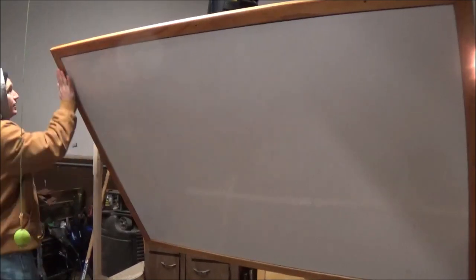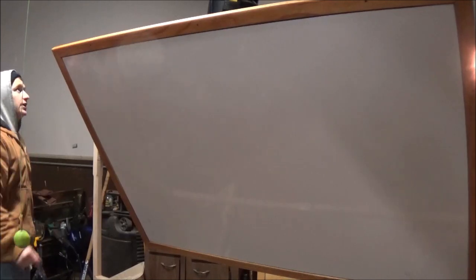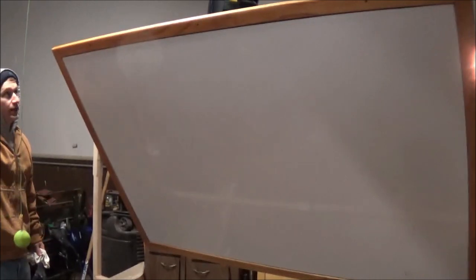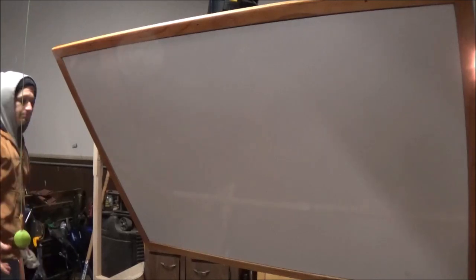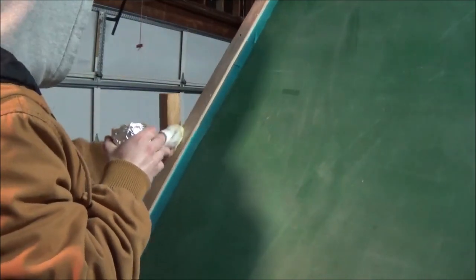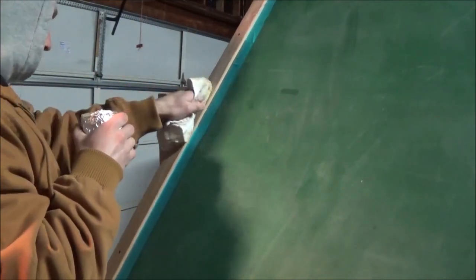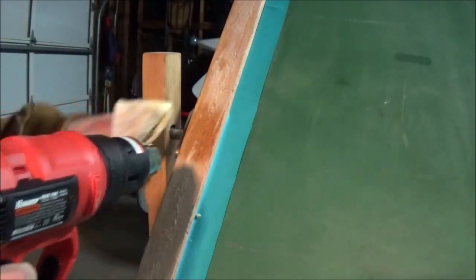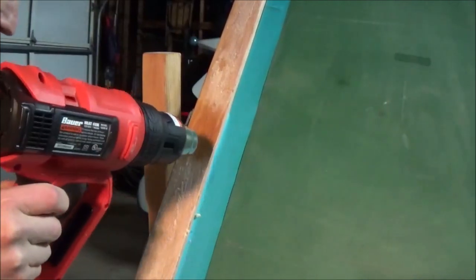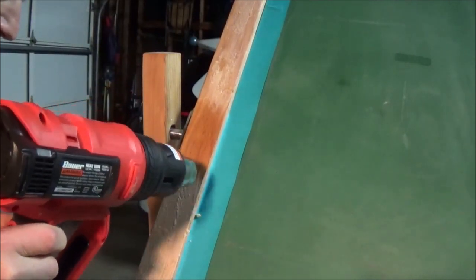Now, so far, I've coated the whiteboard portion in beeswax. I was really just practicing, trying to get it right. And I found it's super forgiving. Just put on halfway melted beeswax, heat gun it, mush it in, heat gun buff it, call it good. I'm going to show you how to do that. You can watch it just kind of soak into the grain. Smear it around some, hit it, smear it, buff it, hit it, smear it, buff it, and so on.